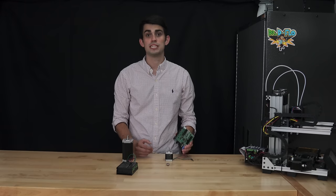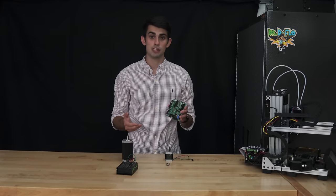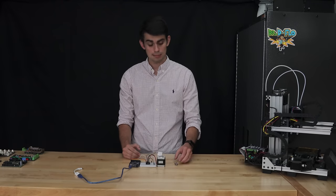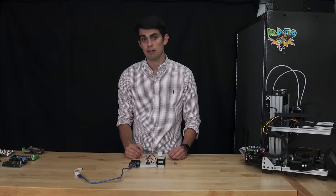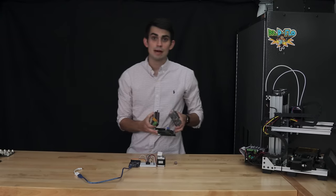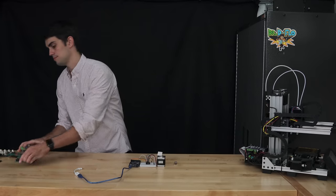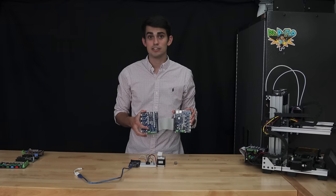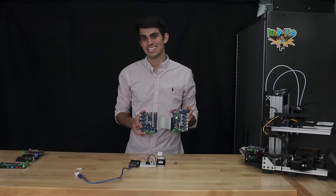However, issues arise when these 3D printer motherboards are adapted for larger applications like CNC machining, which uses larger stepper motors. The stepper driver from our examples has been the A4988, which is an extremely common and cheap driver. All of the previously discussed motherboards, except for the Duet, use this driver. The Duet, on the other hand, uses Trinamic TMC2660 drivers.